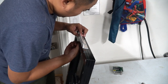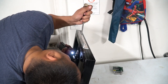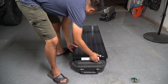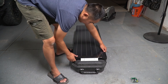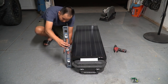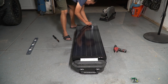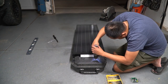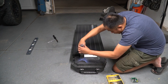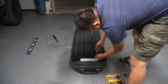You can find this hardware at your local Home Depot for relatively inexpensive. I'm using a power tool here but I highly suggest you use a ratchet to manually tighten this down — it just helps speed up the process. I took the rifle box off the truck and laid it on the ground so I can see it easier. The angle iron lines up perfectly with the flat spots in the box. I'm making it flush with the front, then marking the holes so I can drill them out to a quarter inch. It's probably recommended to center punch these as well.